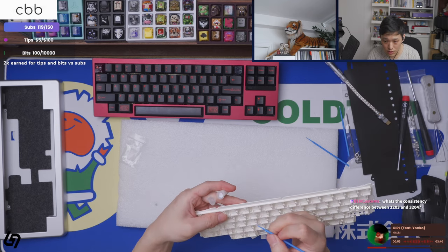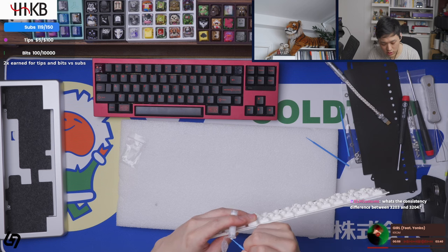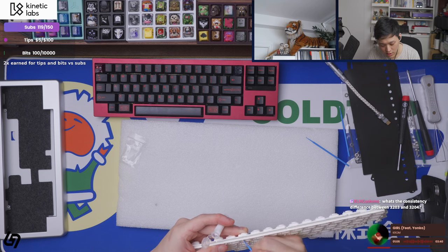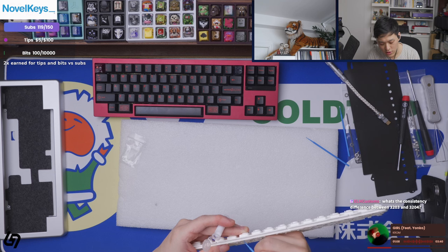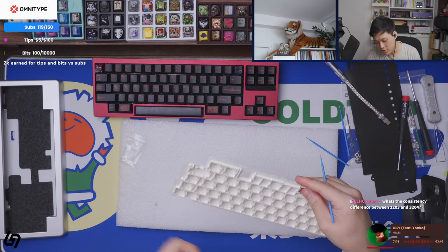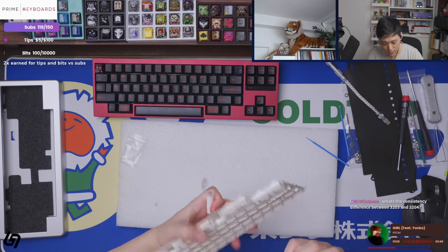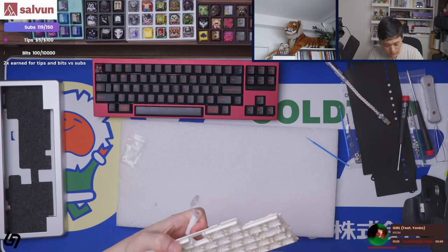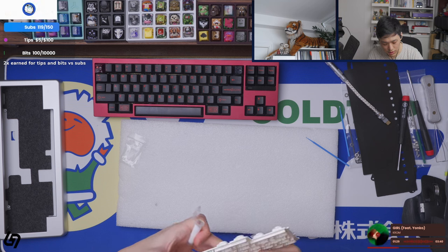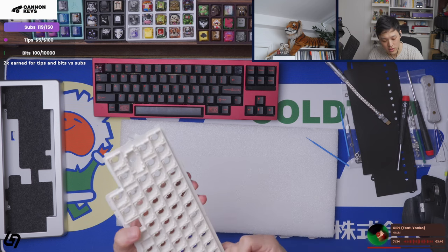What's the consistency difference between 3203 and 3204? Well, 3204 is the equivalent of 204G0, right? And in the grading for Krytox, the first digit is the main medium. So the 100 series are all oils, the 200 series are all greases. And then the viscosity of the fluid is indicated by an increasing number. So 3203 is going to be less viscous than 3204, and 3204 is going to be less viscous than 205G0, and so on and so forth.